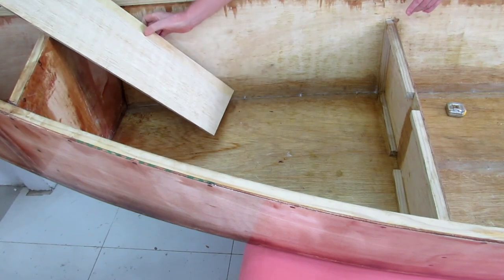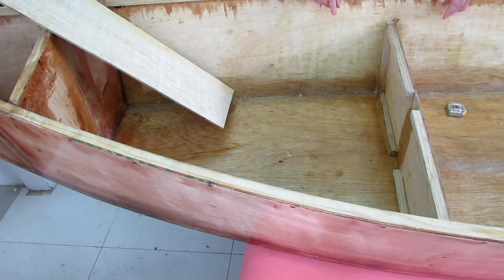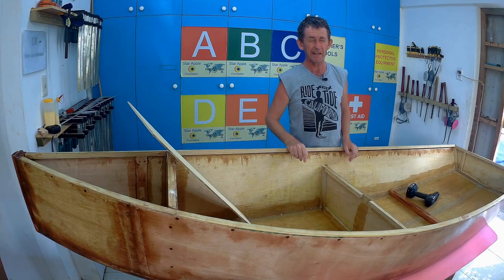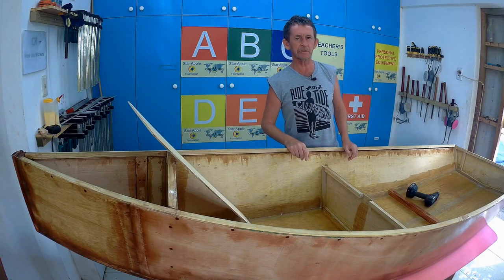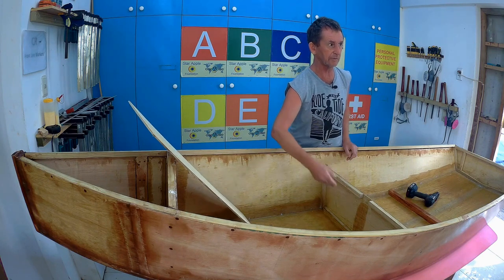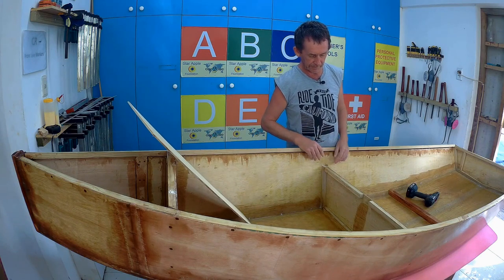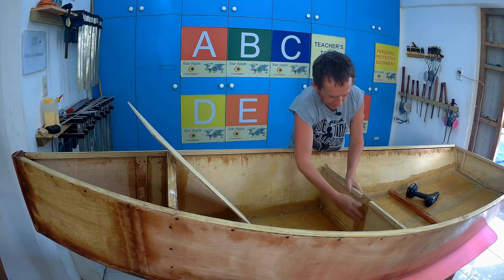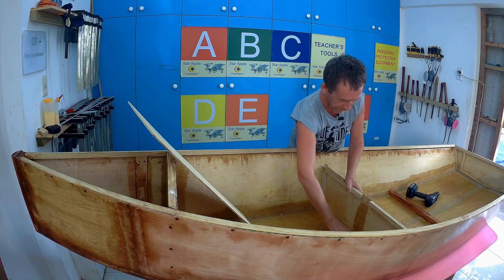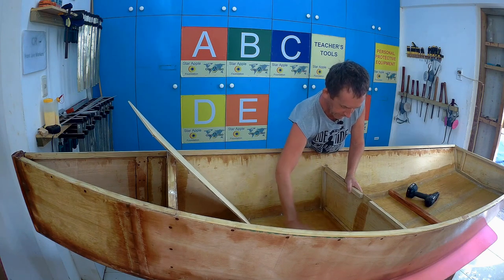The first thing I want to do before that is drill a couple of holes in the boat. When I drill the hole, I'll cut it from the far side - if it cuts a little bit too much, that's fine because we'll be putting lots of epoxy in, fairing the corners, and bullnosing the corner. This area also needs two coats of epoxy. The dagger board case will be glued here, so we'll give it a bit of a sanding - it's already got one coat.